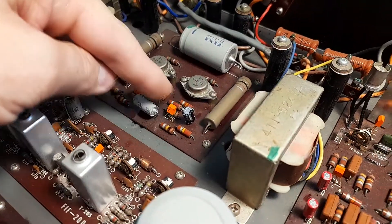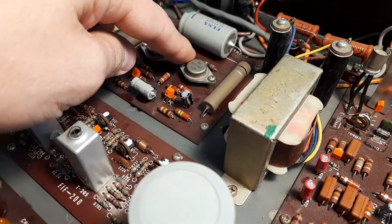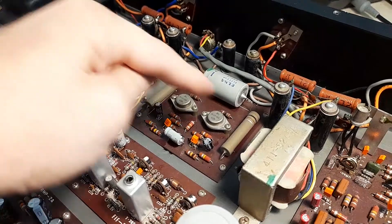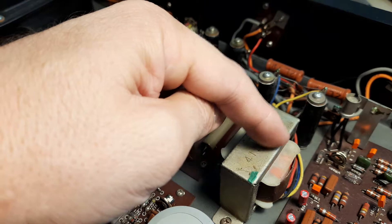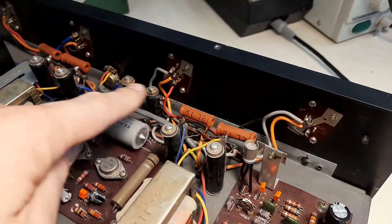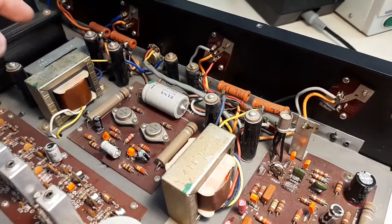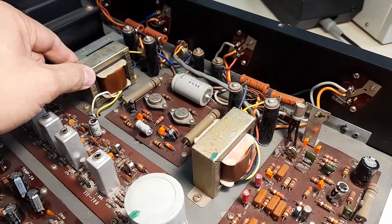There are two little orange input transistors connected to slightly higher current transistors that drive the primaries of the interstage transformers, and those each have dual secondaries that drive the bases of a quasi-complementary pair of output transistors. I must say it sounds very good for 1966 transistor technology — not bad at all.